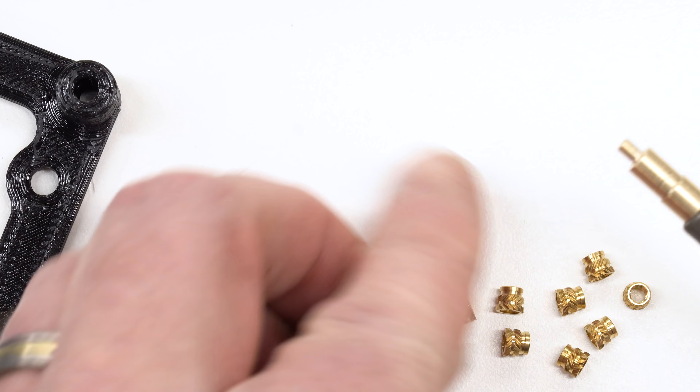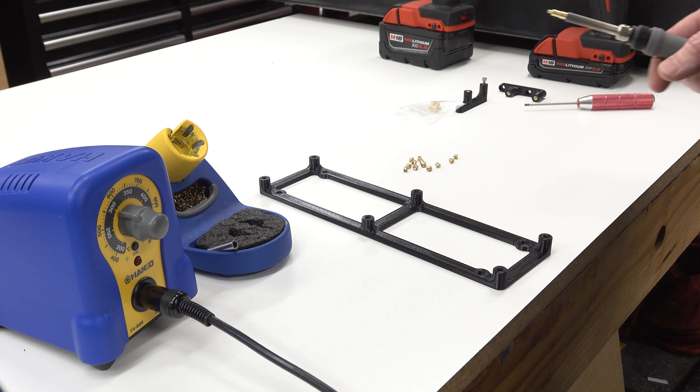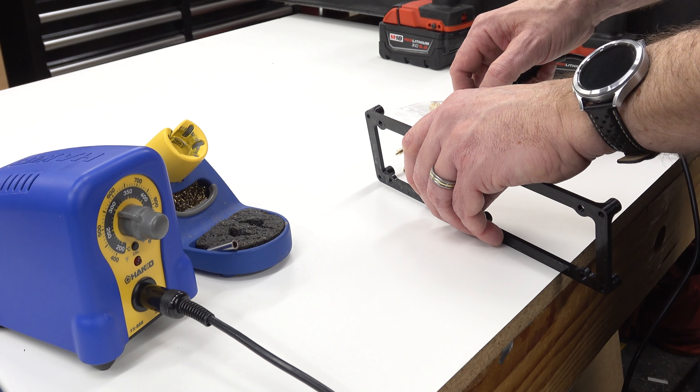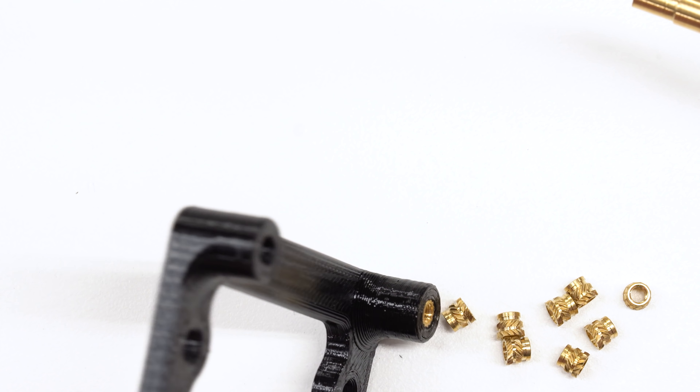That is up to temperature — I have it set to about 300 degrees Celsius. I went ahead and set this to 300 because I'd like to be just a little bit hotter to make it go quickly. I got my part here, and I'll put the insert in the hole first — it has that little 4mm pilot, and that'll go right in the hole. I'm just going to line it up and push it in, just like that, and put it down on the surface just to make sure that the end is flat. And there we have one threaded insert. I'll go ahead and put the other ones in this part and then let's see how the board fits.